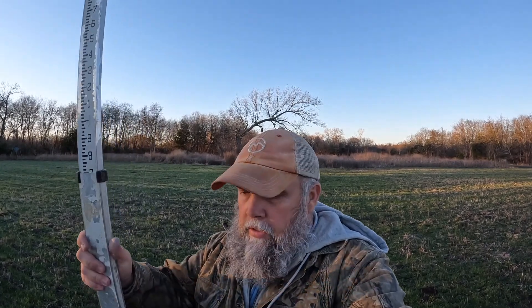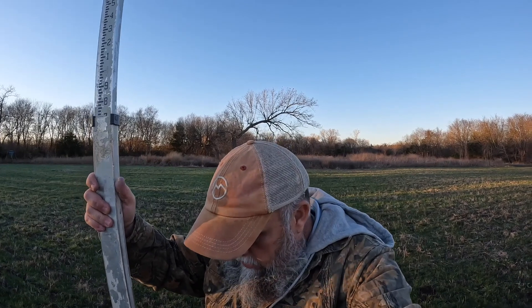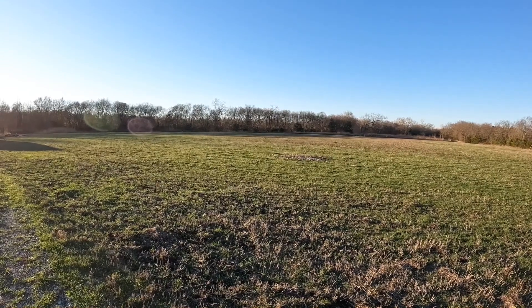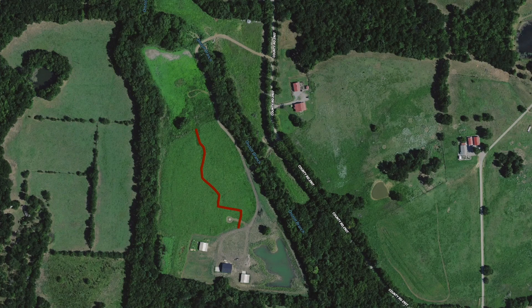I'm almost to the end of the flagging operation across this field, and look what I found — look how much I have to raise this. You can hear the tone there. It's amazing because when you look at this field with your naked eye it looks almost flat, but from my reference point to where I stand right now — probably a hundred yards away — the amount of fall is about a foot and a half to two feet. The precise measurement doesn't matter so much to me. All I want to know is that the water is going to run downhill when I put it in the ditch all the way from up there to down here. As long as I can dig the ditch lower than the surrounding landscape, and the ground pitches from the high ground on the south to the low ground on the north, the water is going to run the direction I want it to.